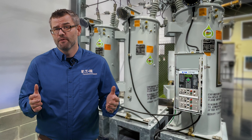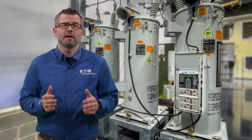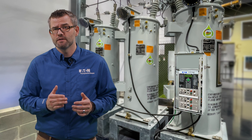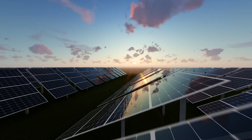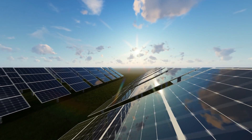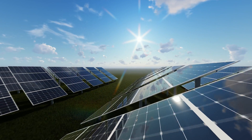Let's examine some of the challenges of solar power. Solar activity can be very intrusive to a distribution system with variations in voltage, especially as solar penetration increases. The voltage drops as clouds cover the field and then rapidly increases as the clouds pass by. This causes undue wear on the contacts and shortens the life of the regulator.